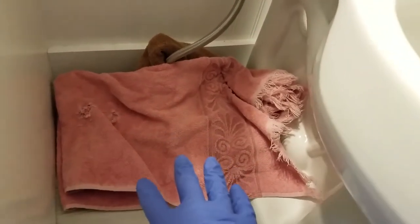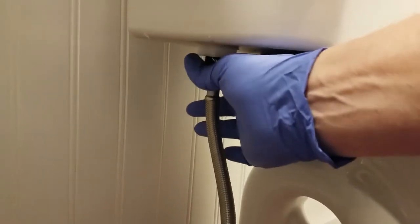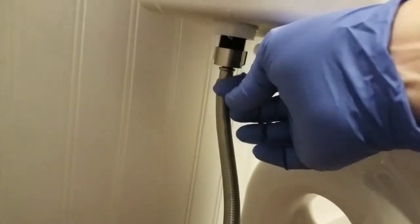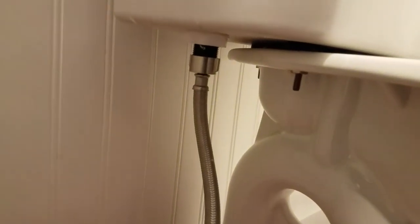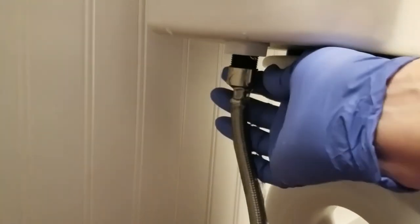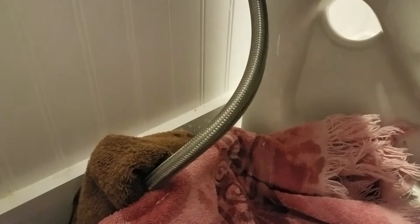For the next part, we're going to need some towels to protect the floor because we're going to get a little wet — we're going to have to disconnect from the toilet tank. This connection up here may be plastic, may be metal, may be corroded on or not. All you're going to have to do is release from up here. You don't want to release from the valve because we're going to put that T-valve up here and then connect this line back to the bottom of the T-valve, and then we'll have a line coming to the toilet seat to feed it. This should just turn by hand, and as you see, it's coming out. And yes, there is some residual water — that's why it's important to have some towels. Otherwise, you may have to face the wrath of the missus.